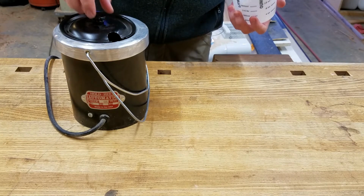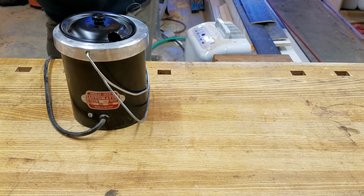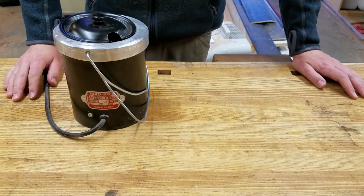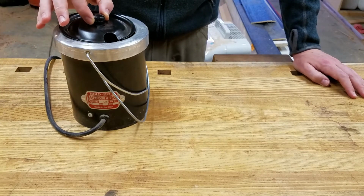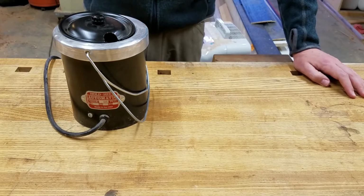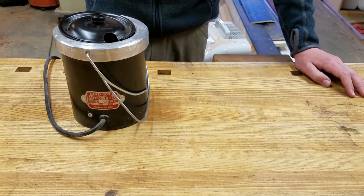There are a number of advantages to using hot hide glue as compared to a more modern PVA glue or, for the truly damned and lost souls in the world of woodworking, epoxy. The primary reasons being this. Hide glue can be expected in a properly fit and glued joint to last in the vicinity of 75 years, but perhaps much longer if the piece is well cared for.